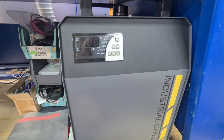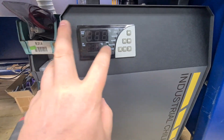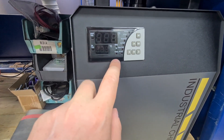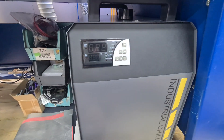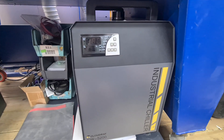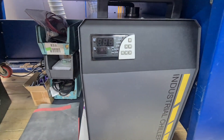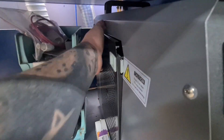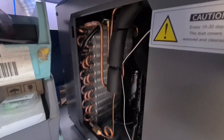I realized that intelligent control mode wasn't going to work for me, so you need to change it over to constant temperature mode. In constant temperature mode you set the temperature you want, and it will bring on the chiller to cool it down, or if it was too cold it puts on the heater to warm the water up. If you take the side panel off, you can see there's an actual proper chiller unit inside — like a fridge compressor — which chills the water rather than just blowing ambient air over it.